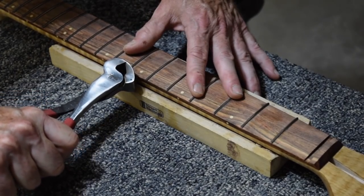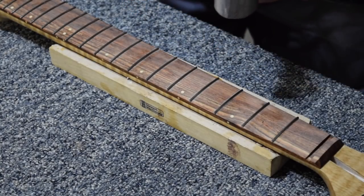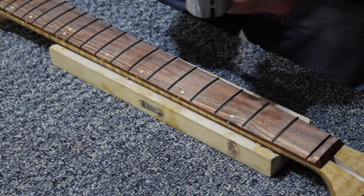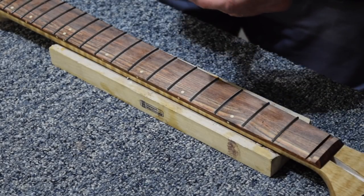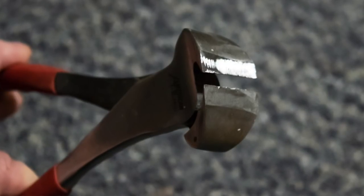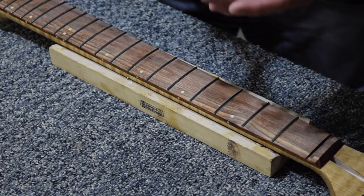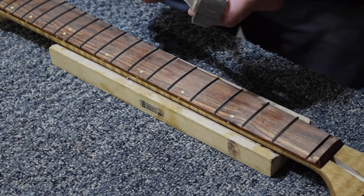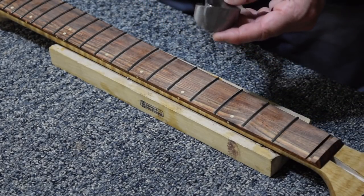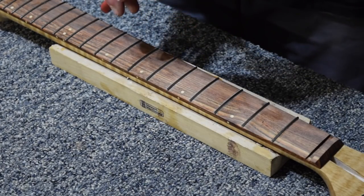The frets that I use are stainless steel, and people always complain about how hard stainless steel is on their tools. That may be true to some extent — I think it's really more of an issue with diamond-coated tools than anything else. But for this cutter, I've been using it for years. What I did was grind the face flat with my bench grinder, and every so often when that edge gets chewed up, I'll just take it back to the bench grinder, grind it flat again, and I'm good to go. Eventually the tool will be beyond that point, so I'll replace it — these are no more than about ten dollars. I'll put a link in the description below.